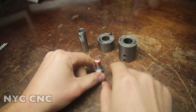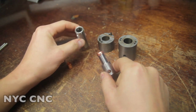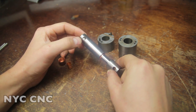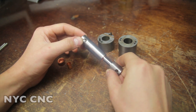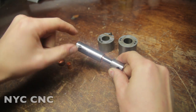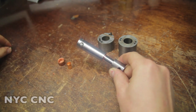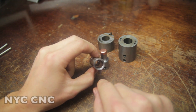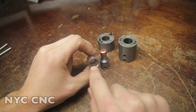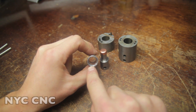Here we are. Now this was stuck a little harder than I thought inside the die. So all I did to get it out was I drilled a 1/4-inch hole in the top of the die. That let me stick a dowel pin through the top. And then with the dowel pin down there, I had a way to twist these without marring up the surface finish. One reason it was stuck so bad is I didn't drill the thicker counterbore deep enough, that last drilling operation we did with the drill slightly over 1/2 inch.